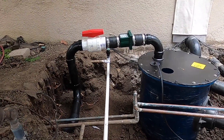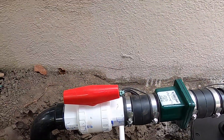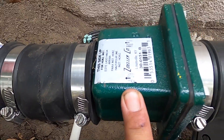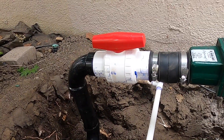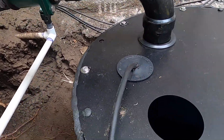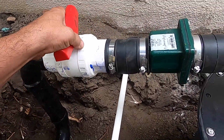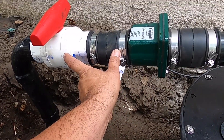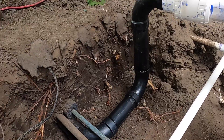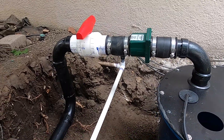Here's our setup with our check valve and service valve on the discharge pipe — all the raw sewage goes to the main line this way. The check valve, or one-way valve, prevents sewage from going back into the pump. There's also a ball valve used as a service valve for whenever I need to service the pump or check valve — you can turn it off and limit the amount of sewage water in the system rather than having the whole line come back on you.